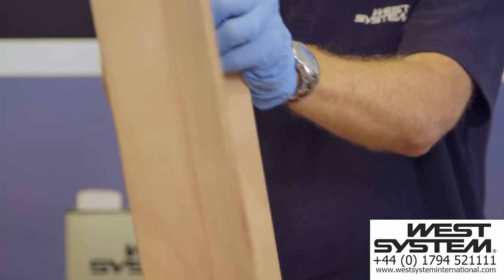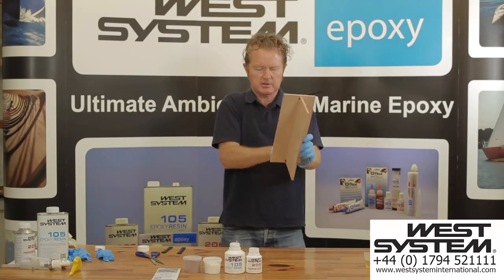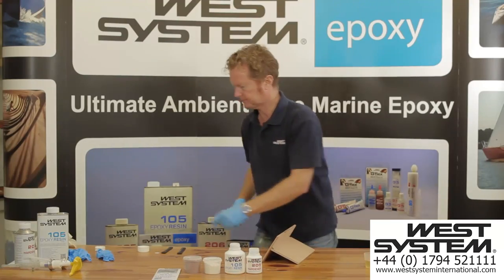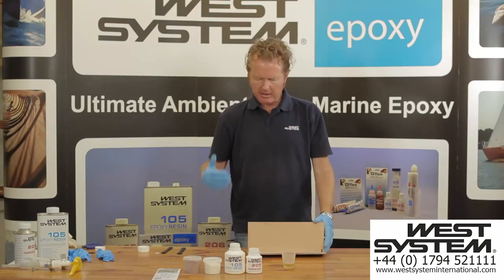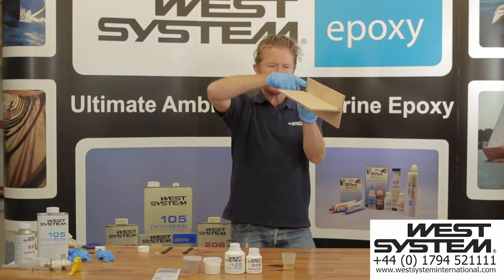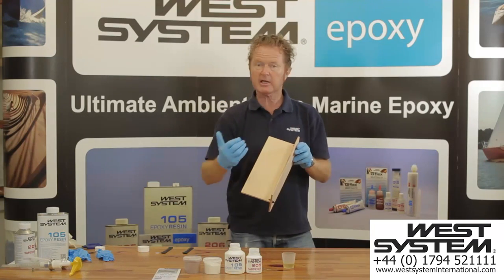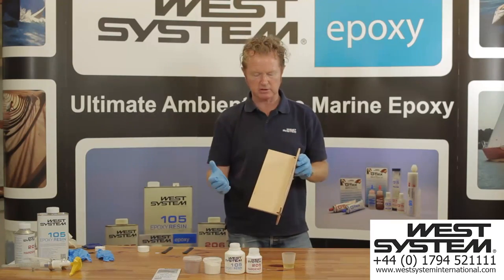Pull them nice and tight, and that really tensions up your two opposing panels. And for this demonstration, I'll just cut the end of the zip tie away. Now, one of the techniques involved in stitch and glue is to create a fillet. A fillet is a cove of thickened epoxy that becomes a structural component of the whole boat construction. It's a method of joining panels together in a very, very lightweight, efficient way.